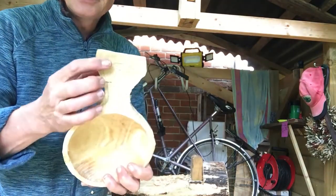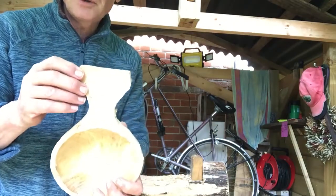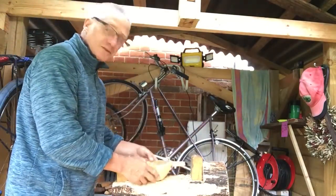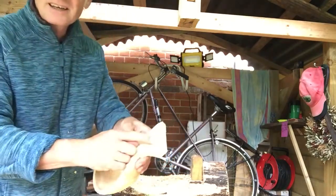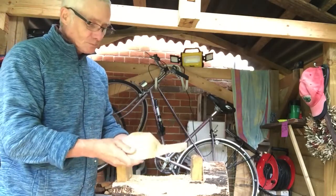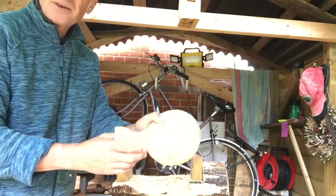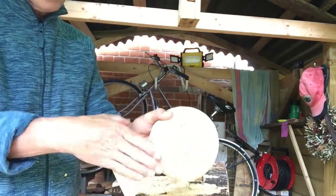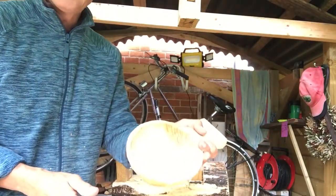What I've also done is to redraw back in the fishtail handle to work with now, because I'm going to shape that. One of the things to notice at this point is that the Kuksa is still unbalanced. So the weight of the tail is still too much. So we're going to take some length out of that tail, and we're going to carve it in here. We're also going to carve out under here and neaten all this very rough material, bring a kind of curve in there, so it will facilitate holding the Kuksa, because this is essentially how it will be held, like this.